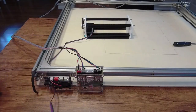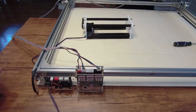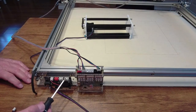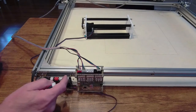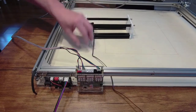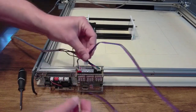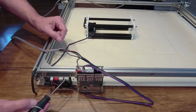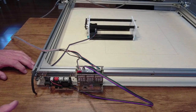Now we're at the back side. This is the old laser board, and this is the new laser board with the new 40Y. If you have the old laser board, this right here is your Y-axis — disconnect that plug and plug this one in here. For the new one, this is your Y-axis — just pull it off and plug it in up top there. This is your Y-axis on the new one, and this is your Y-axis on the old board. From there you just have to configure it in the software, and I have another video for that.